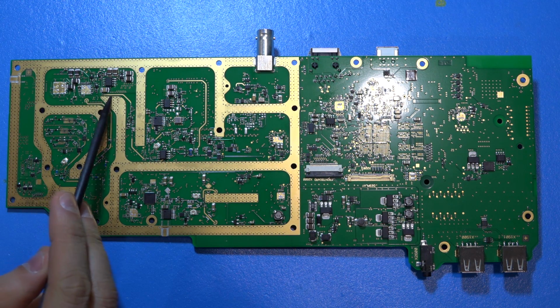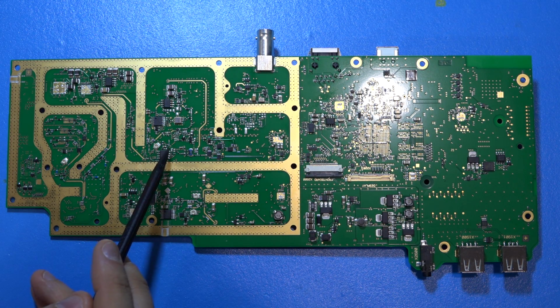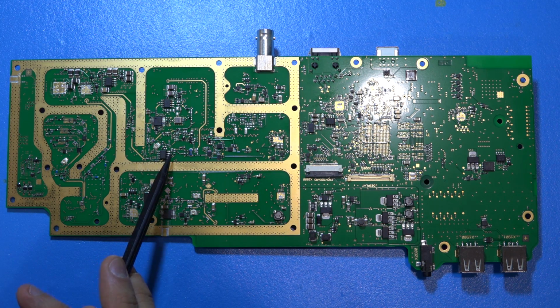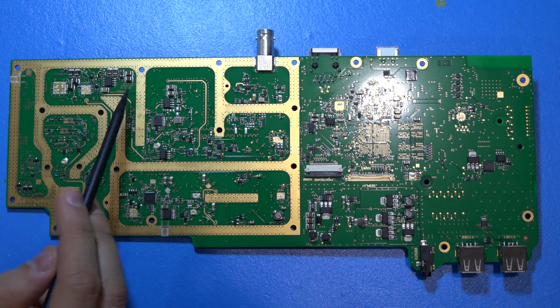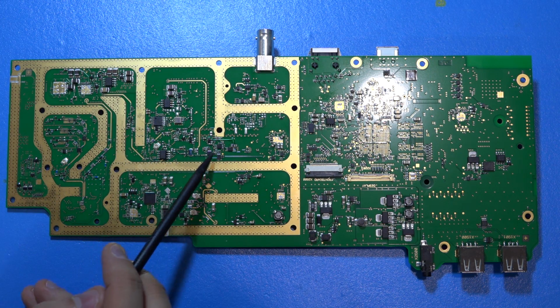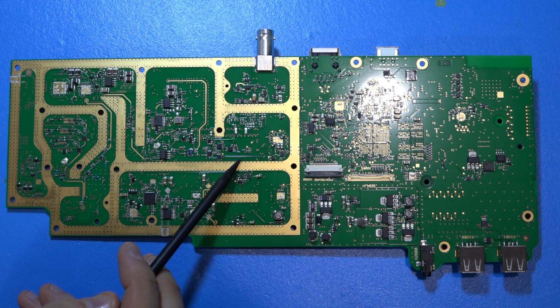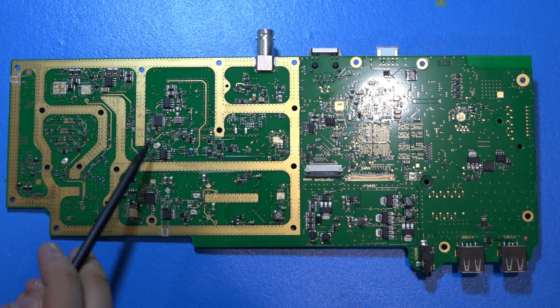And then at the same time, they send a signal over here, and this goes through the board to the other side and is the frequency reference LO for the 900 megahertz down conversion stage. At the same time, this portion uses an LO signal again generated by the same circuitry in order to create the clock for the final A to D converter. You can see a differential line going right over here, going through the board to the other side. So the differential clock of the A to D converter is also generated ultimately by the same synthesizer core architecture.